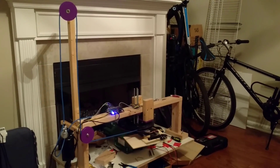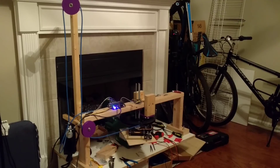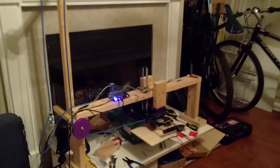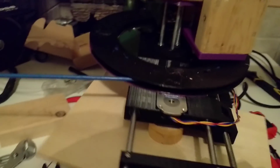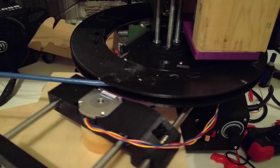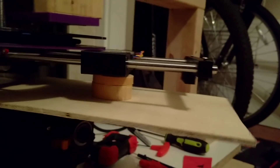The very first version was a completely terrible idea, but pretty fun to build. I intended to have a stationary rotary axis, a linear axis that moved along its radius, and then a final rotary axis to counteract that first rotation to orient the workpiece correctly. That little stepper motor was never going to work. I also had to design a cable reel to manage the cables because the entire assembly needed to rotate — I had plus or minus two rotations from center.